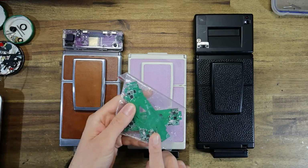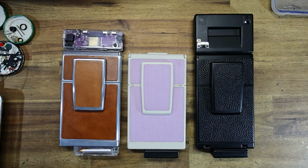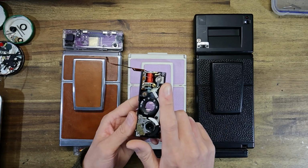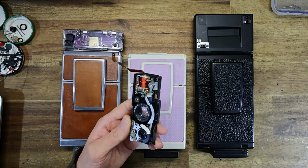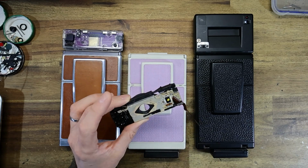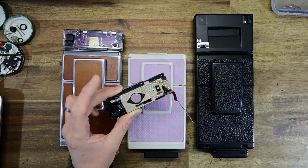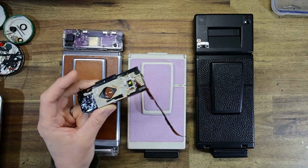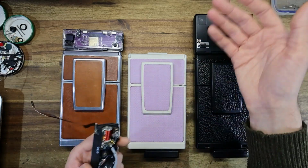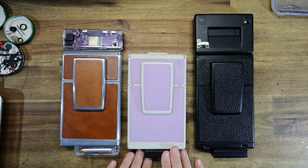For me to install one of these PCBs is not quite as simple as just slapping it in to the back of the shutter housing, where the old one used to sit. On many models, I've got to adjust, modify, or at the very least, clean and calibrate the solenoid. I've got to take the anti-static or wax layer off the shutter blades. It's quite involved, and so it's not something that I can really do as an upgrade per se without making sure the rest of the camera works, because, well, if the shutter is going to work perfectly, I kind of need to make sure that the motor ejection system works perfectly too, and that the rollers are clean, and that the gear train isn't about to break, and lots of different things. And the same goes for the power system.